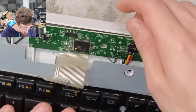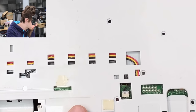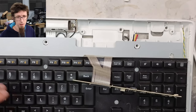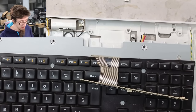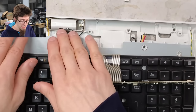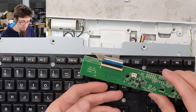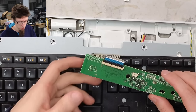There's something else on the back — a funny little grey wire. That extra connector goes to two temperature sensors for the two cells. Because this product has a built-in battery charger, it has to have a thermal sensor to detect if there's a fault with the batteries it's charging — it can stop charging if it senses the batteries are way too hot. Although if they're way too hot, something has already gone wrong, so questionable how useful that is.